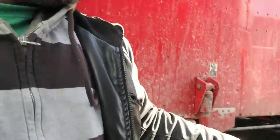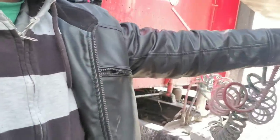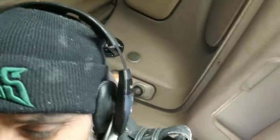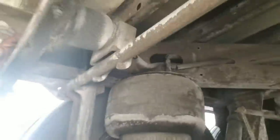I think it was in this part of the airline right behind this joint. I now have air coming through my line. I'm going to double check if my brakes are unlocked. If they are not, I'm going to send some air. If my brakes are unlocked, that means my problem is solved. My airbags are inflated and my brakes — there is a little bit of a gap in there — you can see they are unlocked. I can hear the air noise.